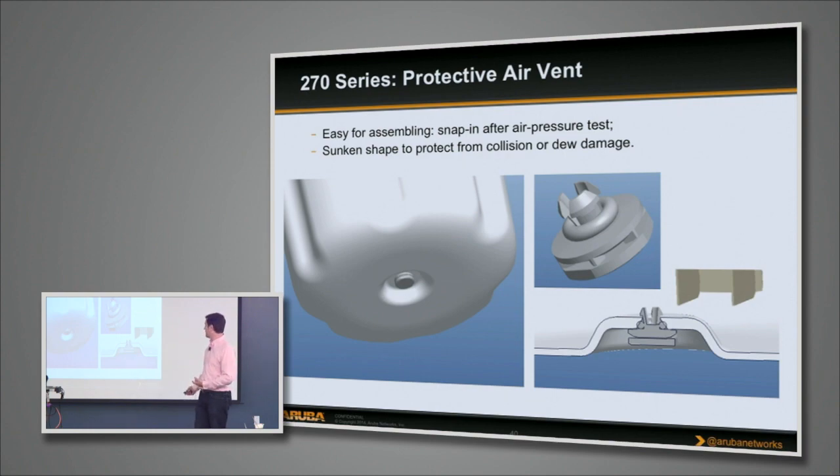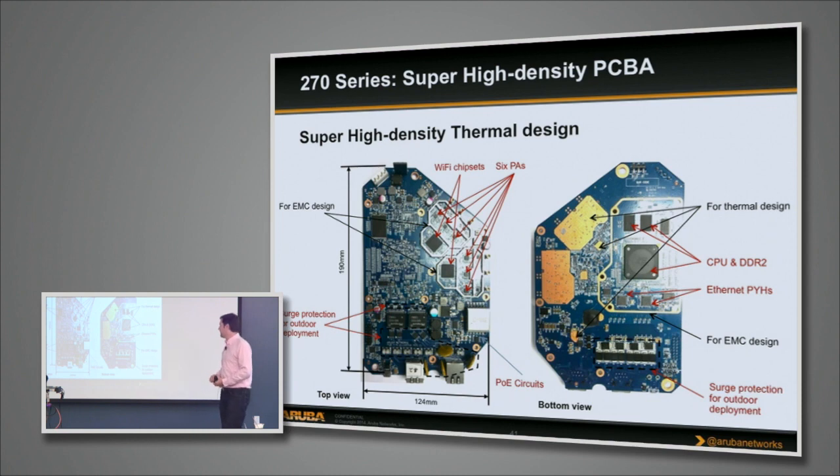Looking at the board inside, the radios are actually directly connected to the board — it's not a daughter card. Part of the reason for that was heat dissipation and cost. The power amplifiers give off about 9 watts of heat on their own and are a major heat generator. They're connected to copper heat sinks on the back that are directly touching the enclosure to dissipate heat as quickly as possible. These are industrial-designed CPUs, memory, and everything else from a temperature standpoint — so no heaters, and 150°F really is 150°F with no problem.